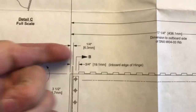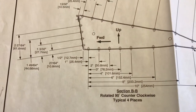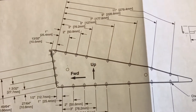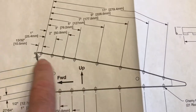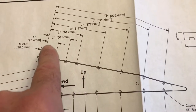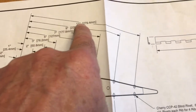I'm going to drill those holes for those rivets. It shows B-B for each one of these ribs — see that — and that is indicated in section B-B. It shows the measurements for where those holes for the rivets go. On this top side I'm measuring from the top: 3/32 of an inch, then one inch, two inches, three, five, seven, nine, and eleven inches down.